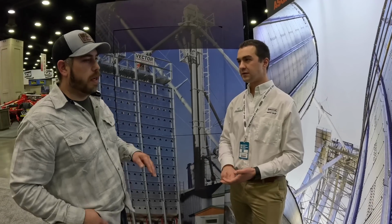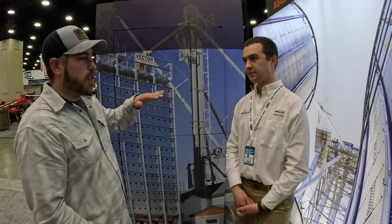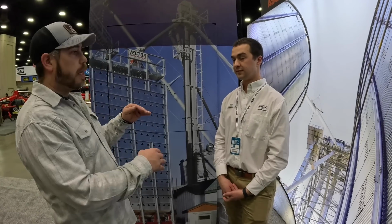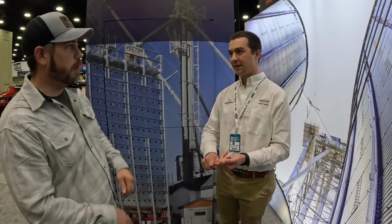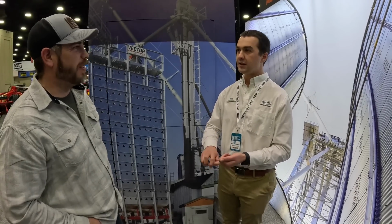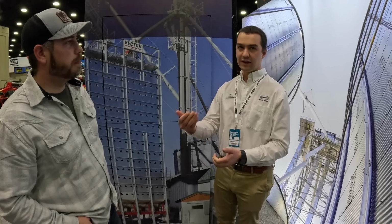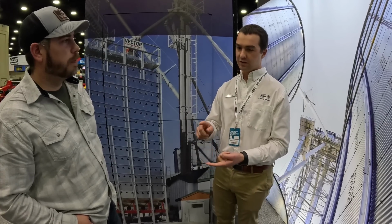So what do you say about having multiple burners? The underbelly fan is one burner, less maintenance, and then overall less expense versus multiple heating systems, if you will. Yeah. I mean, one is flexibility. I've hit on that about 1,000 times. Yeah, you've said that. But the next thing is, if a component fails, you can keep running. Yeah, you have not redundancy, right? It's like, we have redundancy. So we have multiple flame controllers.